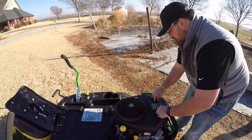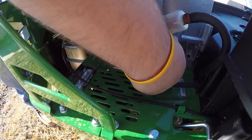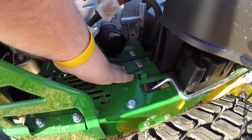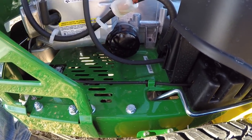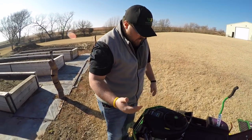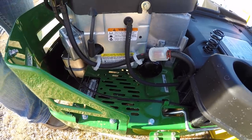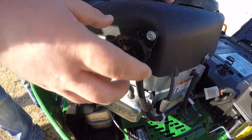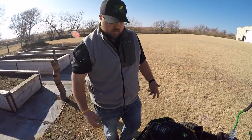On the right-hand side you've got your oil filter, fuel filter, and serial number plate. The oil filter is easy to get your hand or filter wrench on. There's also a built-in divot in the deck — like a little bowl — with a drain hole so when you pull that filter off, oil drains into the reservoir and out through the hole, keeping oil off the rest of your machine. Next to it is the inline fuel filter — two clamps, pull it off, replace it. And there's also easy access to the fuel pump if you ever run into fuel delivery issues.